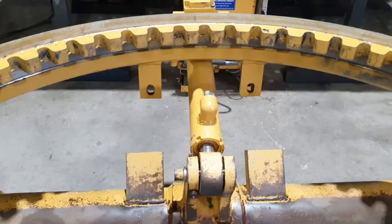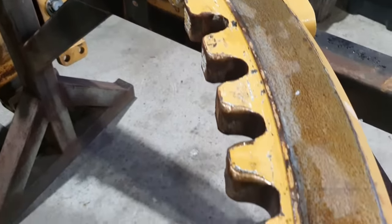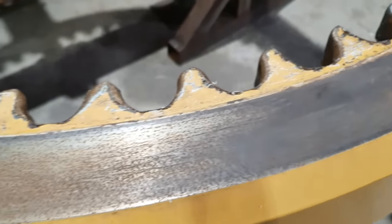So there is a hydraulic motor, gearbox, and a gear or sprocket up this end that actually controls where the circle goes to. Essentially this is just a really big sprocket, and the drive motor and gearbox up this end with the other sprocket on it works on the inside. Because they don't use the full circle of the grader, they only sort of use the front four or five segments, they do get worn out a lot.